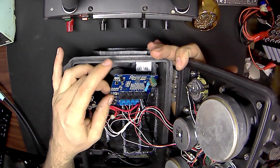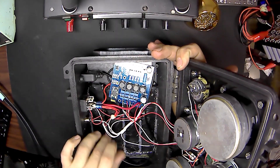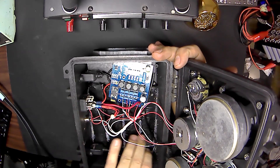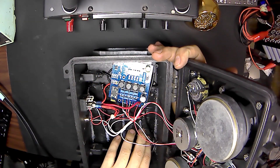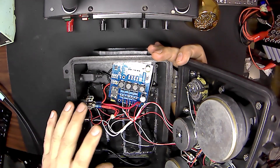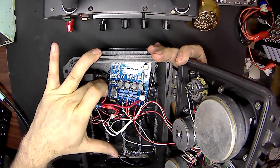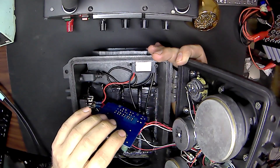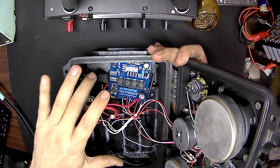This was the Bluetooth amplifier — you can find these on eBay. It's a simple two-channel amp. The ground wire runs down to all the battery packs, which were not 18650s in the beginning; these simply come out of laptop batteries. They're flat packs, still lithium ions. I built them individually, wrapped up in tape. Underneath the tape is a BMS board on every one of them, so that way I don't have any problems with charging or discharging. They were hot glued in. Underneath the board, which was bolted in, is a 12-volt down to 5-volt buck converter that allows me to step down and get to the two USBs.